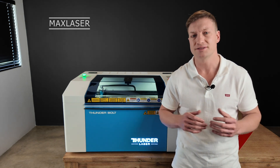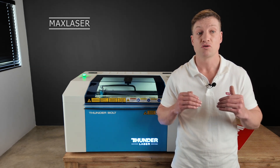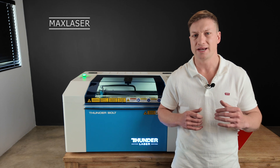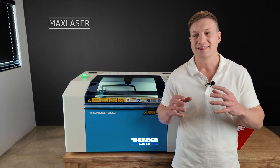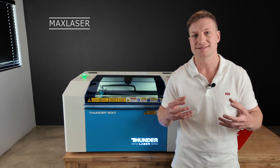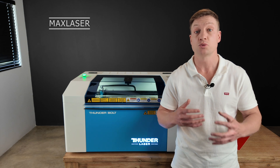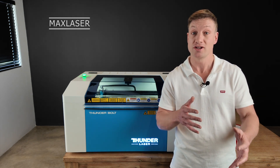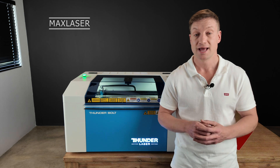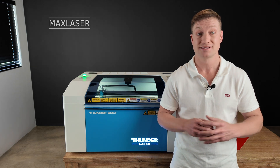This material is great for laser machines. The one issue that people have is when engraving big bold text with colors that contaminate each other - like white on red, red on white, white on black - there's a lot of frustration. When engraving, there's a lot of dust that settles on the material and the laser head still has to go over that area, causing contamination. You can see the lines and the color mixing, and some people go over the material two or even three times.